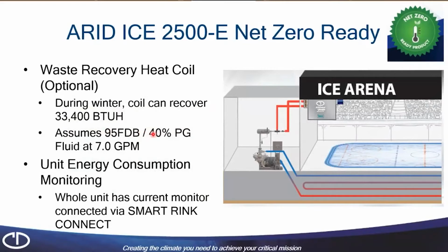I believe so, yeah. And this unit does have a CRN, correct? Yes, if it's provided with the coil, it will have CRN. Perfect. Okay, so in regards to the coil situation itself, I would imagine we'd probably run glycol, but we would get a direction from the engineering department on what we'd finally run. I don't think we'd be running ammonia directly into the space. Yeah, not ammonia directly, but the glycol secondary side, you can definitely run through it. Okay, thanks, Mike. If we need some other fluid, we could surely look at that, but glycol was the initial plan.